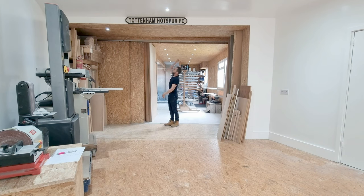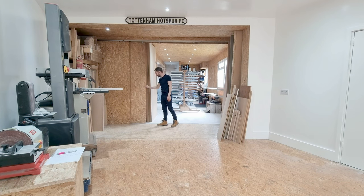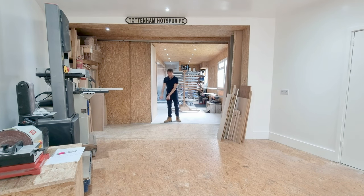So we've got track systems up the top. I think we use Saturn, cheapest ones I could find that are pretty decent, top hung. And we created the tracks at the bottom using plastic profiles. We did it ourselves. We didn't use guides. We knew that they had to be slid in perfectly every time, over and over, and roll over with the wheels. So we just had box section of plastic, and we cut the box section in half, and then it was basically like a little tray. And then we just put the floor around that afterwards, the OSB.